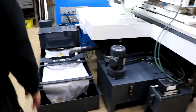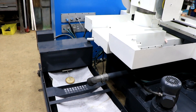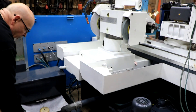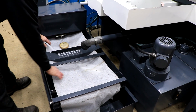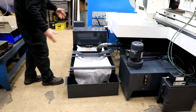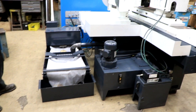Over here we have a really nice paper band filtration system. Everything dumps into here and comes out this pipe — it's going to catch your tools if you drop them in there. You have this paper that eventually fills up and it will lift up this little float, causing a motor to make the paper advance until the paper becomes clean and water starts going down through it again.